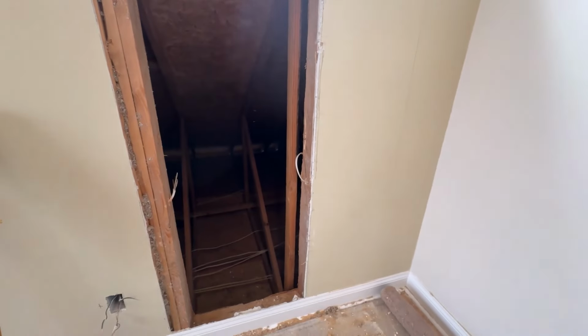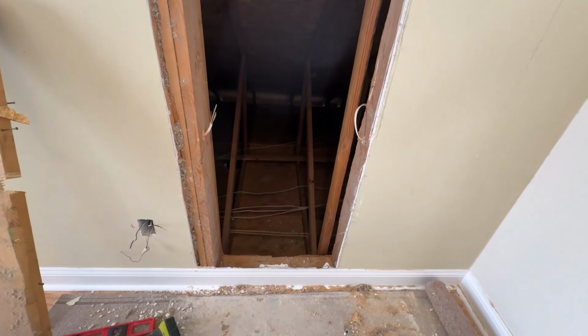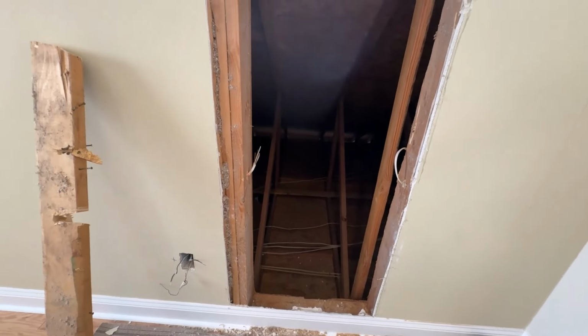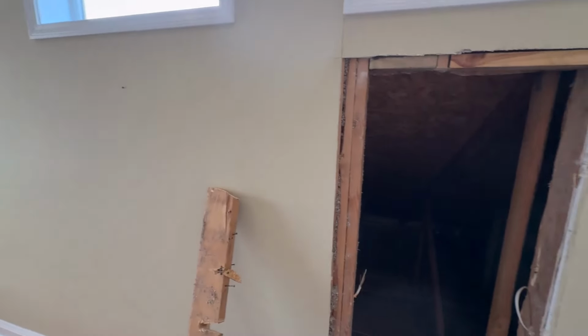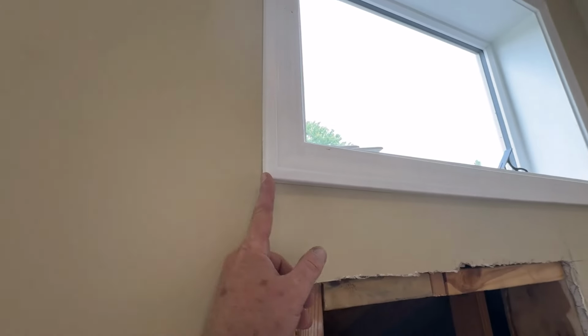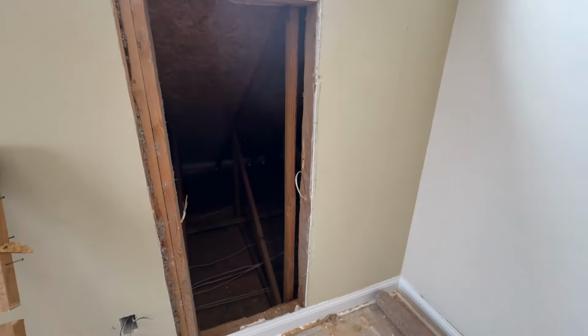that's okay. Hopefully, when I pull off this molding, the wood was close enough to the floor, so when I put this new piece on, it's going to cover the seam. If not, I may have to use 1x4s on this entire wall to build the whole wall out to make it flush. Because I can do that because I have a little bit of room here with these casings on these windows, but we'll see.